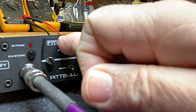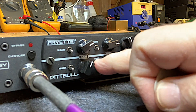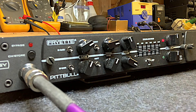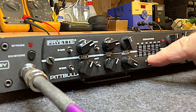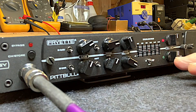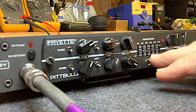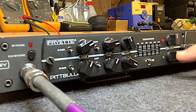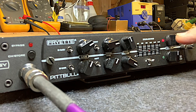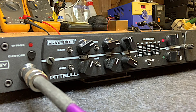The red channel has a more mid-range forward profile over the green channel — the low end is rolled off a little bit, and the mid range and sizzle are more forward, for soloing and sustain. Regardless of the layout of the knobs, the EQ is basically after everything — it's post the master volumes, or channel volumes on the modules. So these determine how much signal is sent to the EQ. There's a little LED right here that's important.